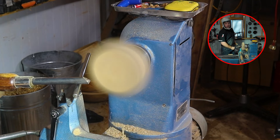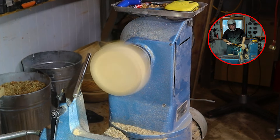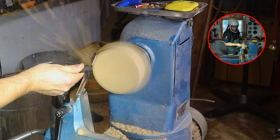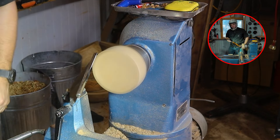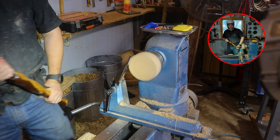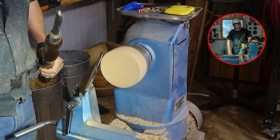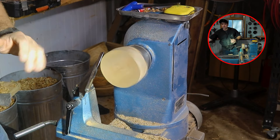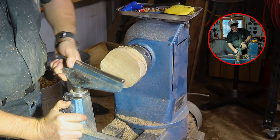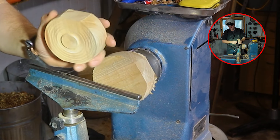I'm turning left-handed so I'm just guiding that gouge across. I've got the tool down low - a tip from Glenn Lucas - my hands in my pocket and the handle goes there, so that's how I know I've got the tool in the right position. I'm not forcing it at all. I'll leave it there - I don't need to cut it perfectly circular because that's just more time on the steel. That's roughly round now, still got flat spots, and now we're going to mark up and form the tenon.